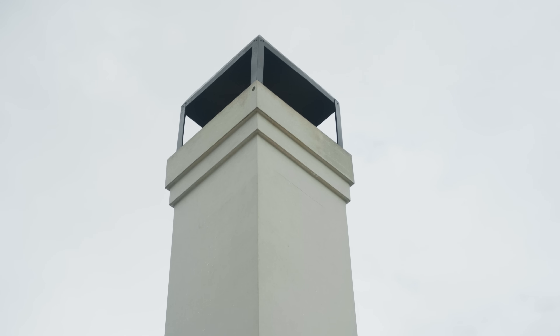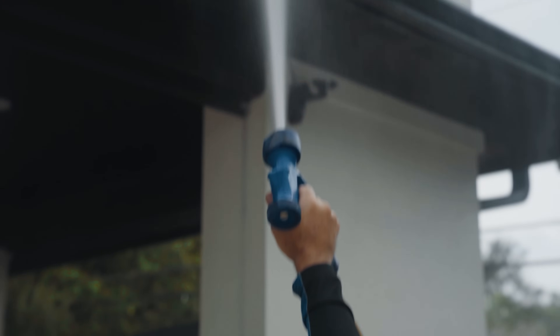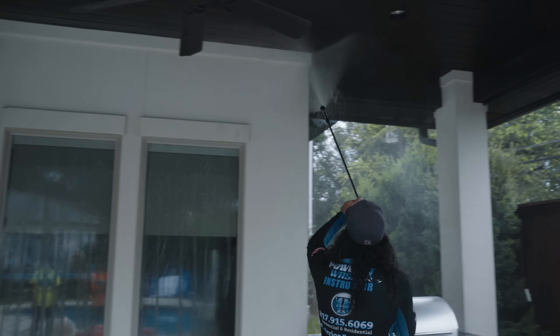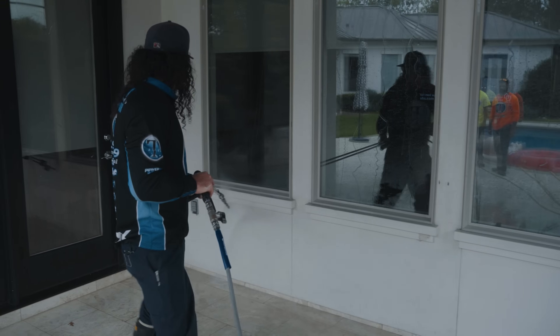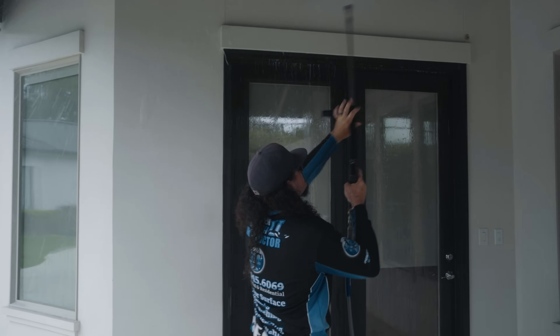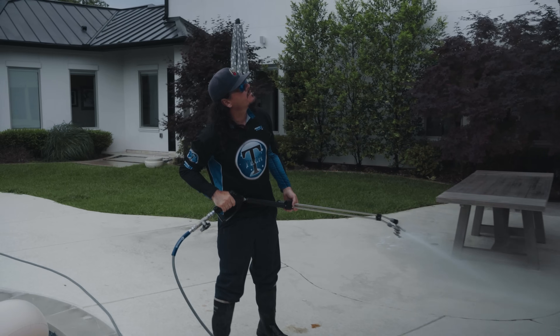Get the top cap of that chimney — see how half of it is still gray? It didn't look that bad when we first got started, it wasn't noticeable. But now when it actually looks clean, we can see what it's supposed to look like. I'm using my soft wash tip with an open dual lance, and that's giving me low pressure. So I can get relatively close to these dirt dauber nests with my gun and not have to worry about damaging the surface. I'm just going to take off as much as I can that way, then come back with a brush in a few minutes and agitate those loose. All that streaking on the side has disappeared — I feel like it's a good time for a rinse.